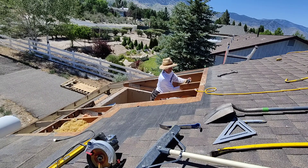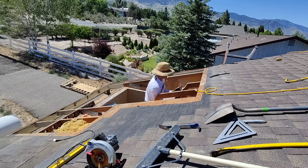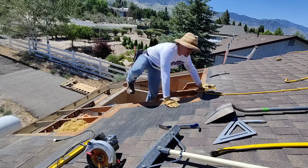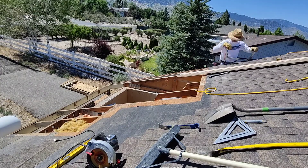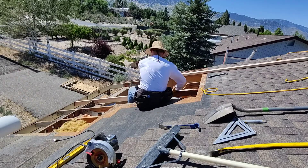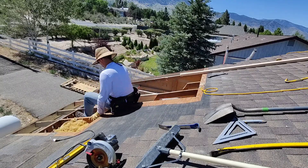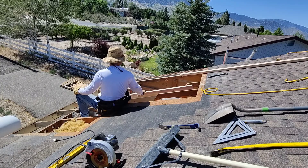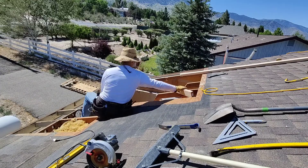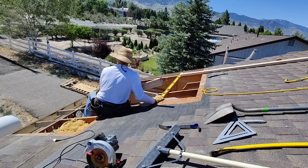So 45-degree — I'm going down and cutting the rafter ends so that it meets nicely with the fascia board at the right angle. Then I noticed that the cut trusses are all hanging a little low. From the gable end there is one truss that is in perfect shape, and the one that I'm sitting on — I lay a straight edge in between and noticed that the trusses have all sagged a little bit.